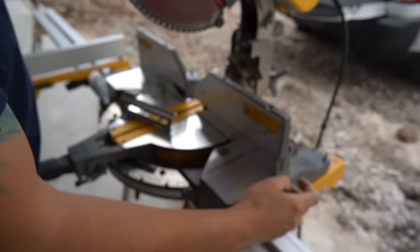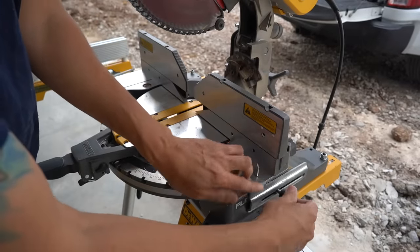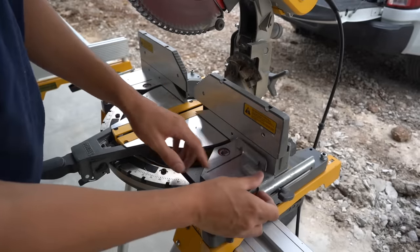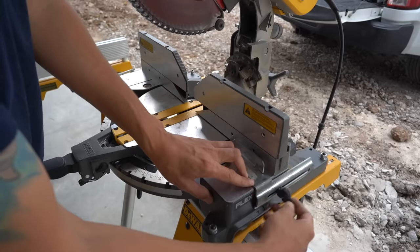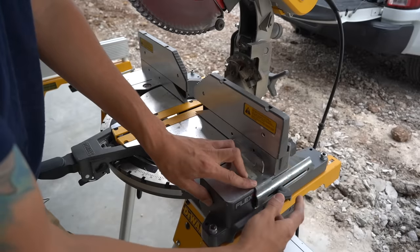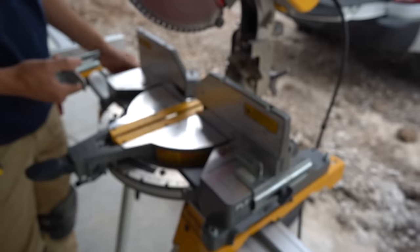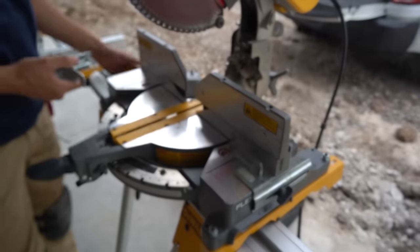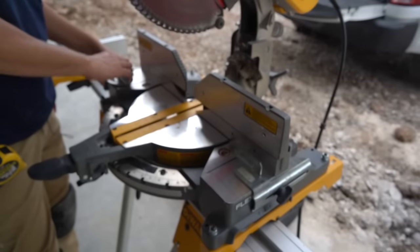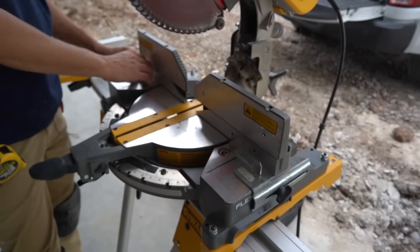So what I like to do with these crown stops is just put them in position so they hold the base up against the fence. So I'll take a piece of base, set it on the saw, and then push this stop up against it. And then when I go to make my miters, that's gonna prevent any kind of bowing out. It's gonna just keep it nice and straight up against the fence. And that's gonna make for a cleaner install because there's one corner in there in particular that was basically a miter that just went horribly wrong when it was cut on the saw. I can tell that that piece of molding in there was not up against the fence when it was cut.